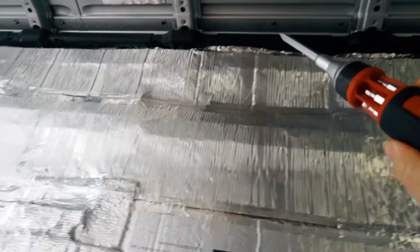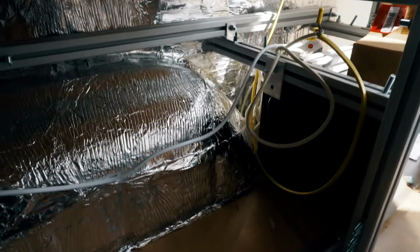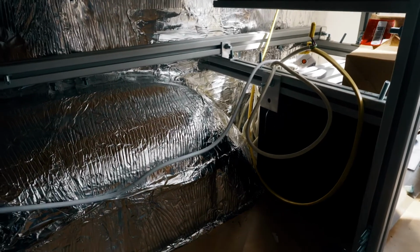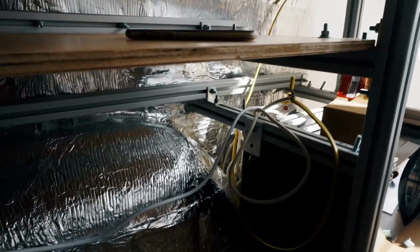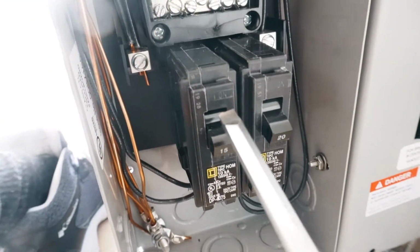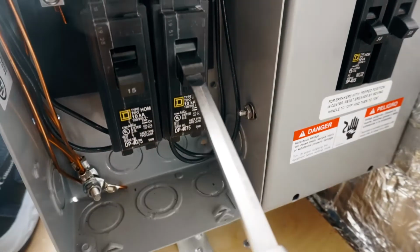I run this wire all the way to the ceiling and then through the black compartment to the front. A second one is just staying over here. It can power other electricals over this section. And another one runs from the top all the way down here to the kitchen section. The kitchen section has so many large appliances that I gave a single wire to this one, and I use 2 different breakers. One is the 15 amp breaker. I use this one for the smaller power appliances in our house, and the larger one, the 20 amp breaker, is dedicated to the kitchen area for the large power appliances.